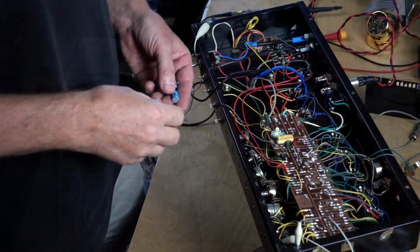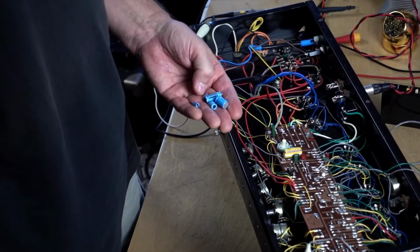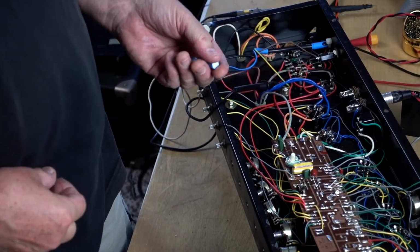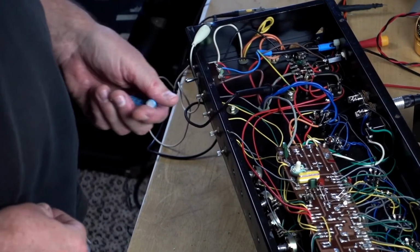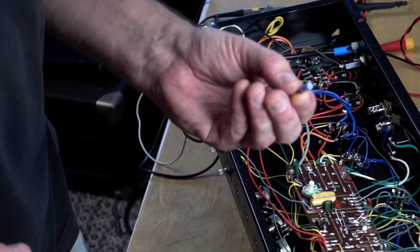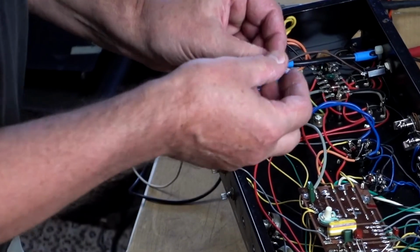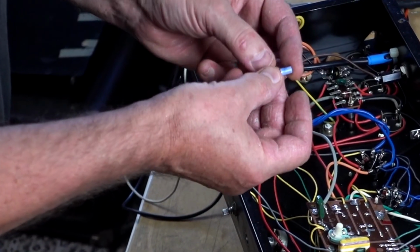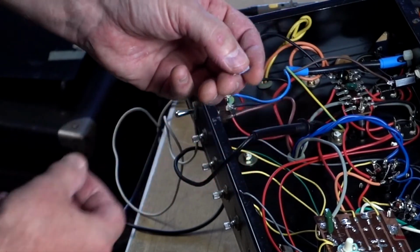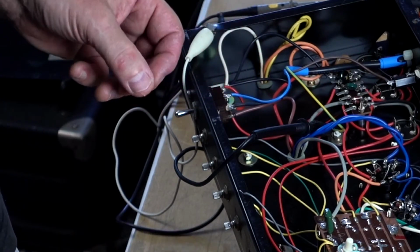The result of my tremolo troubleshooting. A bunch of caps, filter caps. These are all filter caps, most of them from the bias rectifier, negative voltage. Very peculiar one, this guy. Very strange part. Supposed to be 0.47 microfarads, 10 volts. In the filtering section.